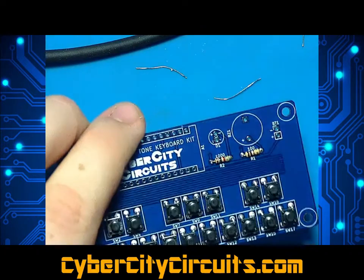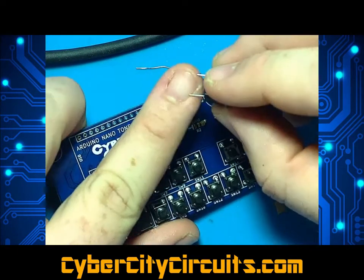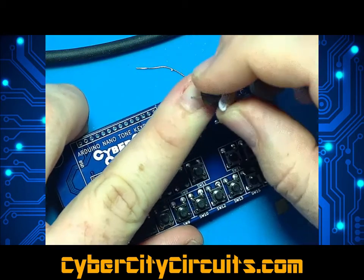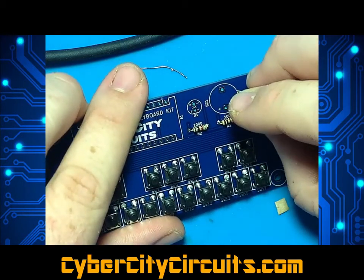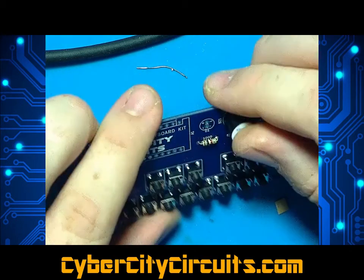Alright, so next, let's go ahead and put in our speaker. Now you notice the speaker has a long lead and a short lead. There's also a sticker on it that shows you which side is positive, and there's a hole on the board marked positive. So it needs to go in that way. If you put it in backwards, you're going to have trouble with it.